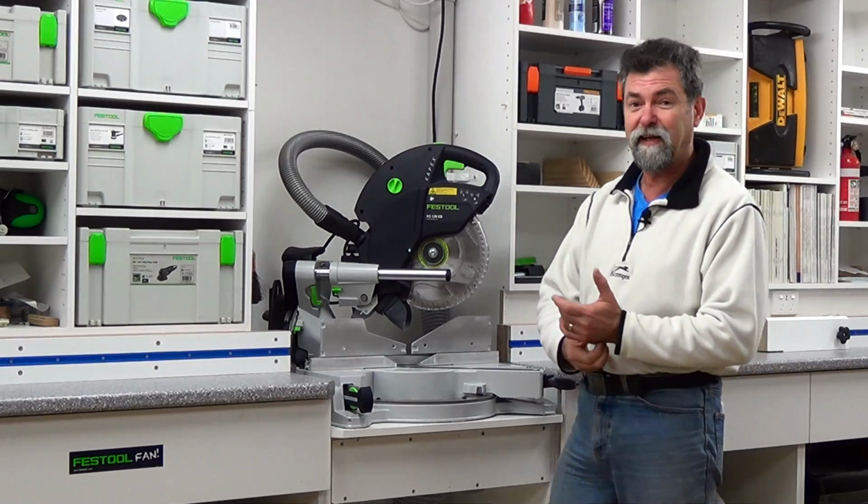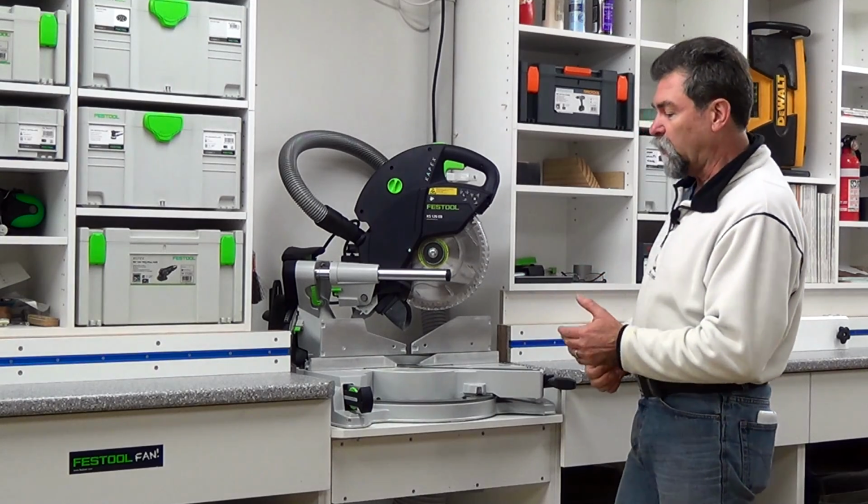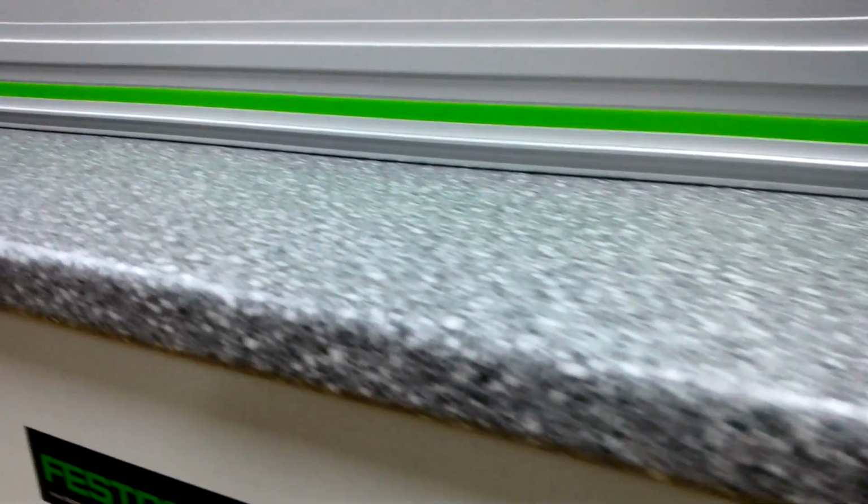I've put nice little chamfers on it, with the melamine iron-on plastic edging, and I didn't do any cutting. I just folded it around and kept ironing as I went, and it's come up quite well. I was happy with that. It's another little thing you learn as you go along. I spent a long time leveling it up with either side. This bench was level to start with.